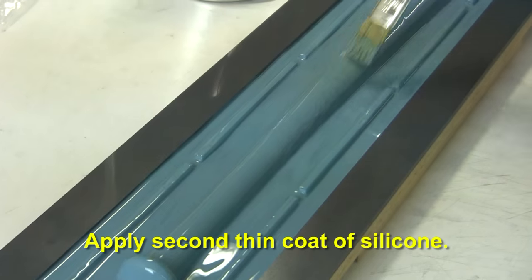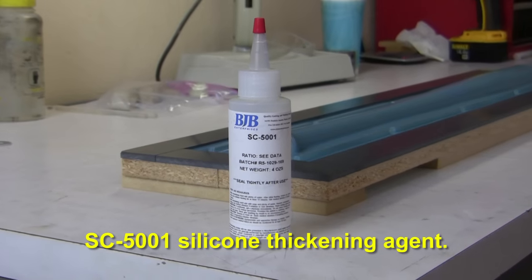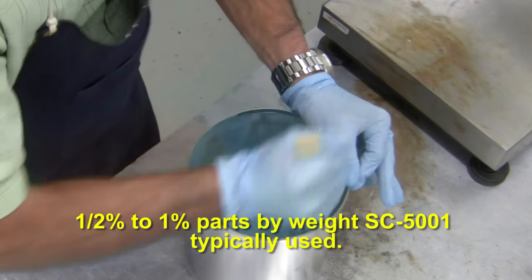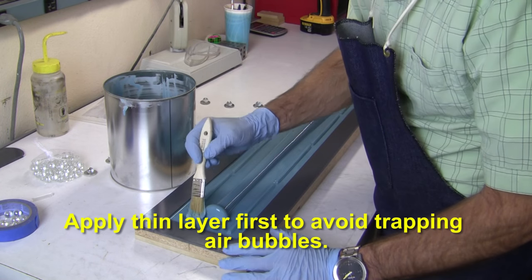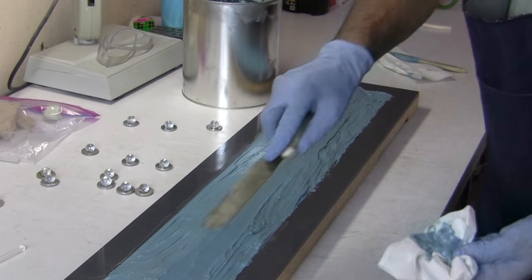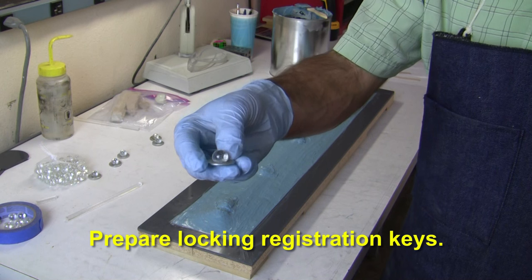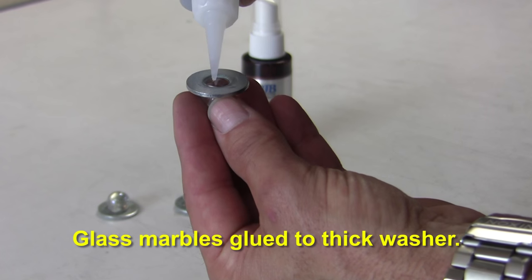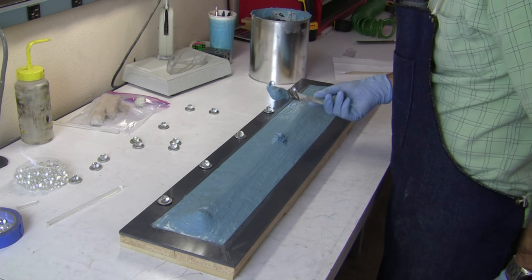We then apply another thin film of silicone to build an additional layer and capture detail on the pattern. For the third and final layer, we'll use a liquid silicone thickening agent to increase the viscosity of the silicone and allow us to build much thicker layers — only a very small amount is needed, so don't overdo it. Within a few seconds of mixing, the silicone turns from a pourable liquid into a paste-like consistency. We'll apply a thinner layer of thickened silicone first to avoid trapping air, then build thicker layers from there. We smooth out the brush strokes with a flat spatula to achieve a smoother overall top surface. Next, we'll begin to prepare our locking registration keys that will keep the flexible inner skin mechanically locked to the rigid outer shell. These simple but effective keys are made by gluing glass marbles to a thick metal washer, forming a flexible snap-fit interface of silicone to the rigid backing so the inner skin cannot slump or move around.